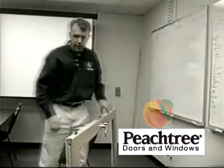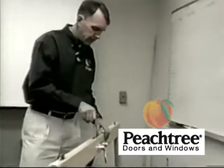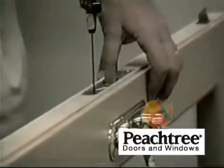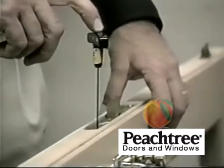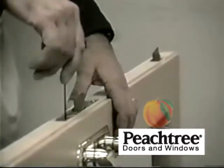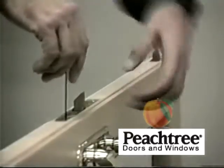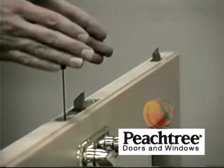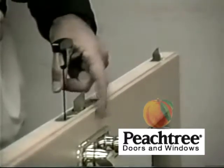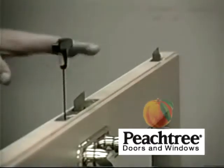So to remove the bottom drive bar, take my Allen wrench, go in the bottom threaded hole, and loosen it about 2 turns. Okay? If you have trouble finding the Allen screw, you might try a ballpoint Allen wrench, or at times you might have to wiggle this Allen wrench around, or turn the lock in and out to find the Allen screw. But most times, it's not a problem to find. Again, it's got to be in the lock position. All 3 have to be on the same plane in the lock position.